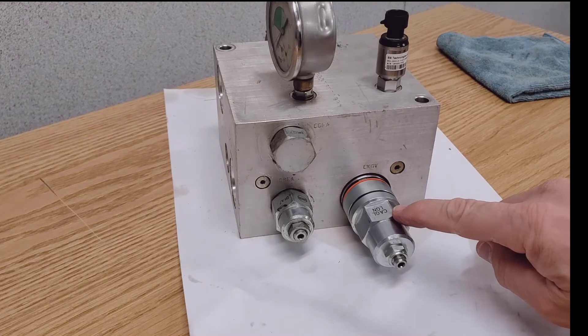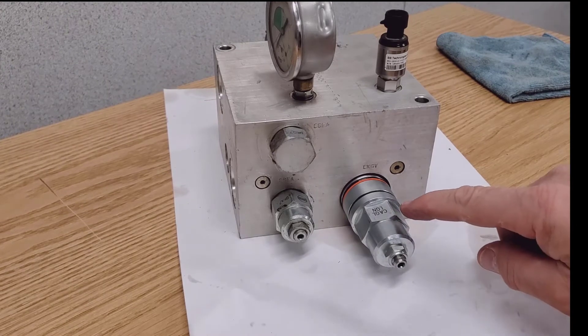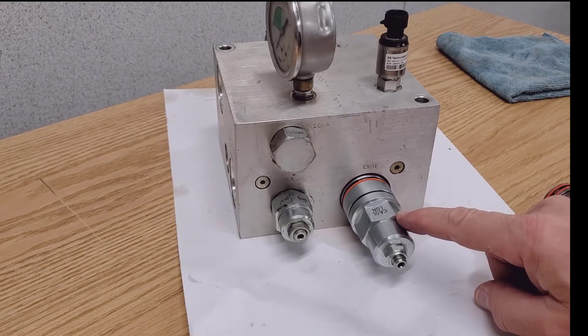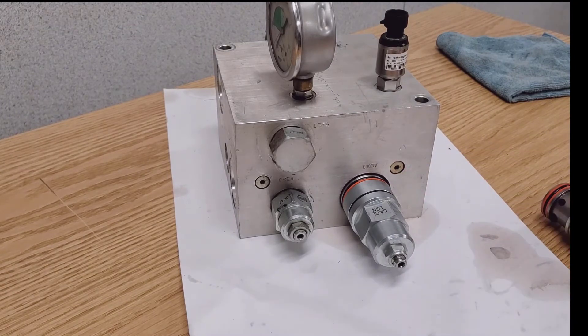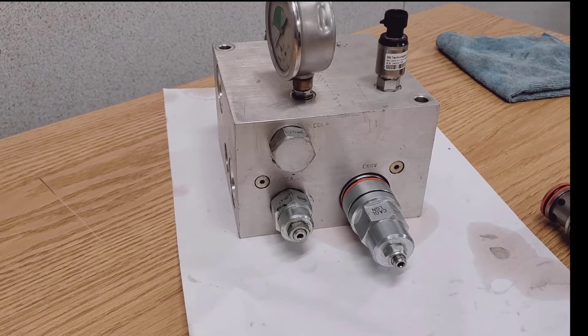You can see the stamping is on this valve. This is a counterbalance valve. To make a long story short, what this valve does is make it so it takes quite a bit more pressure differential for that to happen — so it effectively holds up the openers a lot better during transport or storage.